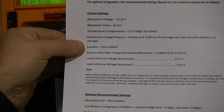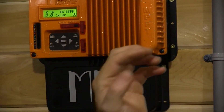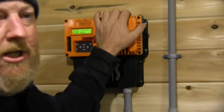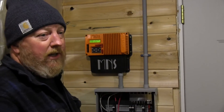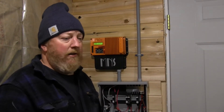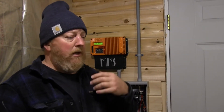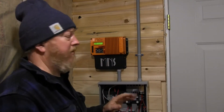We're going to show you how to program the KID for the lithium battery. What we're really trying to do is show you how to set up the charge controller for lithium, and we'll talk about a couple of gotchas that could come back and bite you. The numbers I'm using here are representative of my particular battery — if you're using another lithium, like Fortress, Battle Born, or Simpliphi, make sure you get the numbers specifically from them. Use my programming menus, but not my numbers.